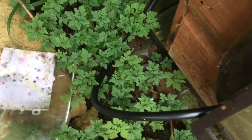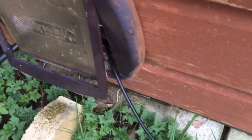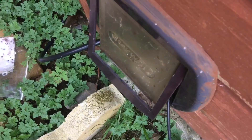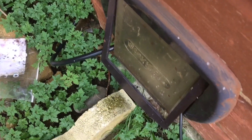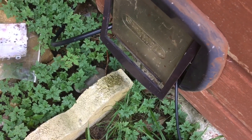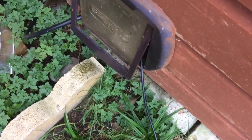Unfortunately I've got no way of bringing the ladder line into the house, so this is the way I've got to do it. I've got RG58 running into the house about 30-40ft. The plan is to replace that RG58 with RG213 and run it around the perimeter of the property, it'll be about 50ft, because I'll have a mini shack installed in the conservatory shortly. That's the install, simple as that.